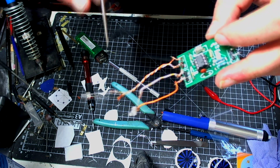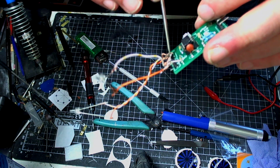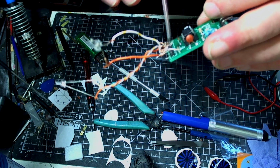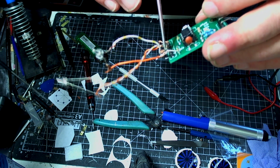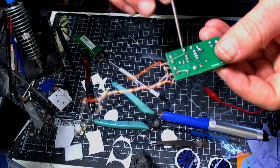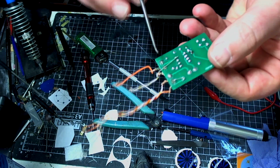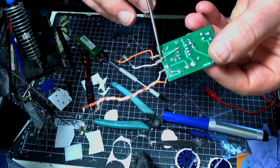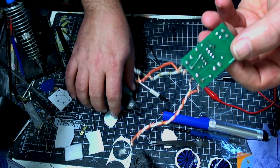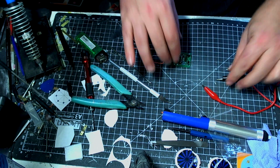So what I had to do then is, well, if I thought this area was the problem, I created another shunt with just a little bit of wire coming from the negative to the negative here, and then I decided to put another shunt from the resistor to the positive on the top here. It's not perfect, in an ideal world, but it's there and it's working. And then, because I thought this was also a problem, I decided just to add another shunt just here, which I actually need to clean off a bit. There we go. Clean that off just a little bit. And now, whew,